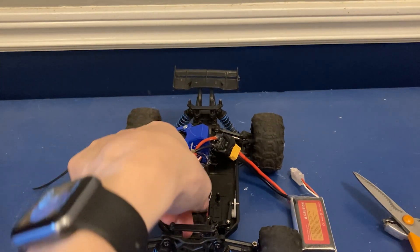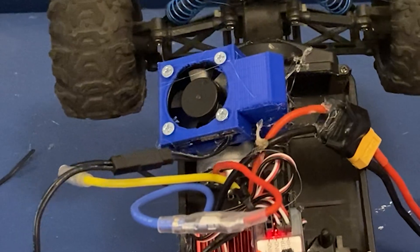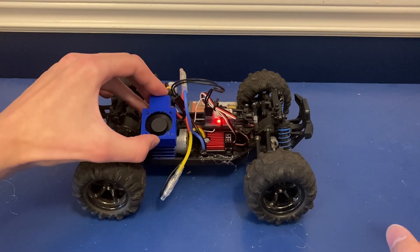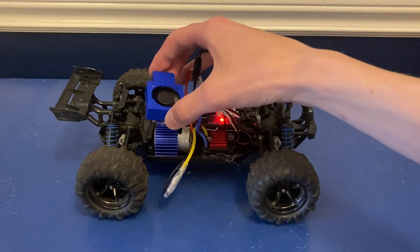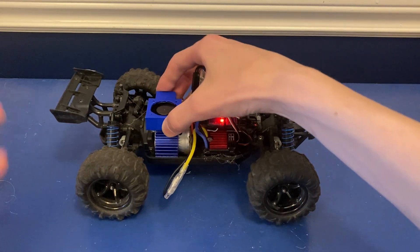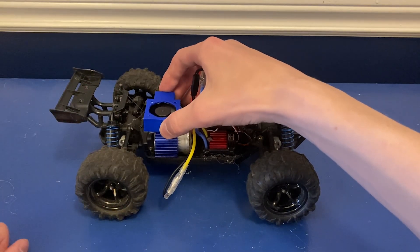All right so I think I found the problem. When the fan is right on the motor it doesn't spin, but once I lift it up you can see it does. So I think what's happening is that this fan is just really really powerful and the magnets in the fan are interacting with the magnets in the motor and it's sort of getting stuck. So the solution is just to hold it a little bit further away from the motor. I've redesigned this mount and I've got a new one 3D printing right now.